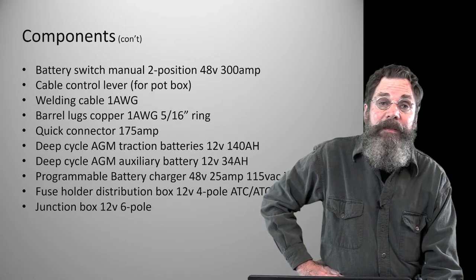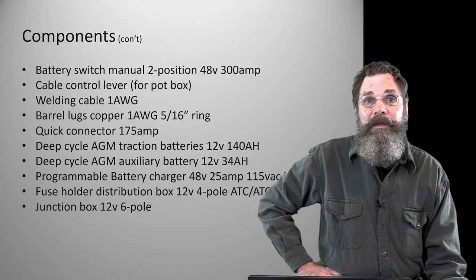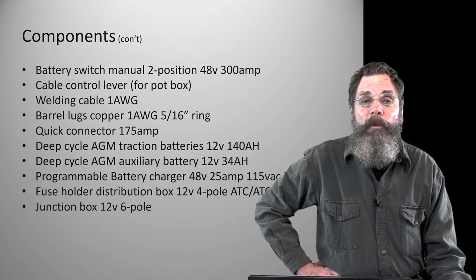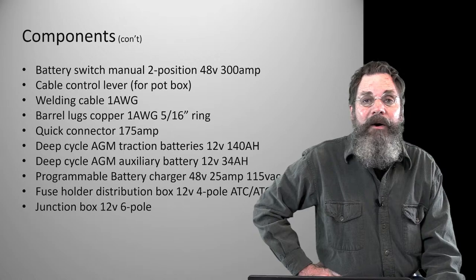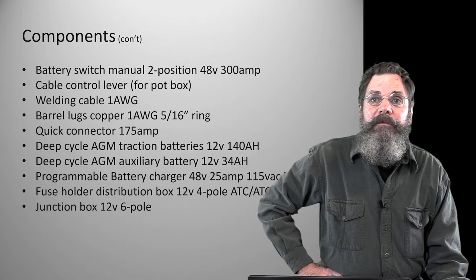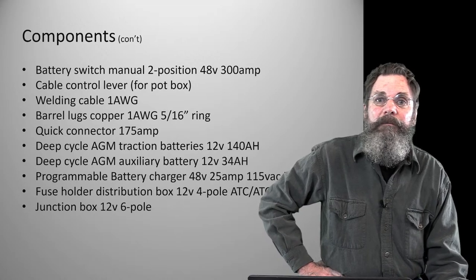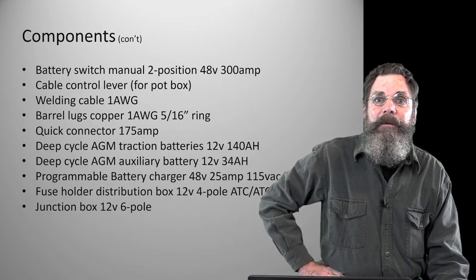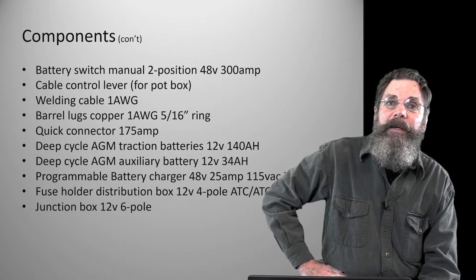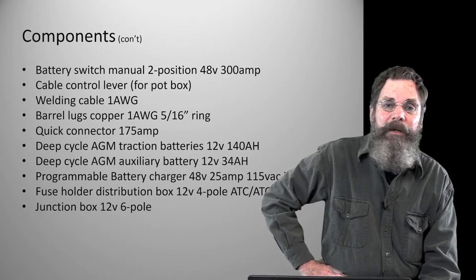To make the connection at the ends of the cables, you cut the cable, you strip back the insulation housing, and you have this little stub of an inch or 3/4 of an inch of pure bare copper wire. A barrel lug, they call it, with an eye loop on the end, gets pushed over that bare copper extension on the end of the wire, and then a clamping vise or a tool is used to crimp that copper barrel on the lug as tight as you can imagine, and it clamps it on there and just won't come off.